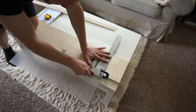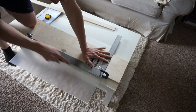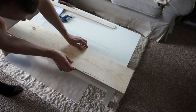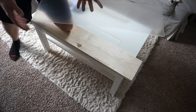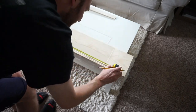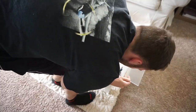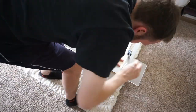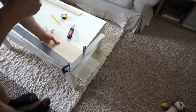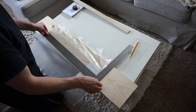Then you need to take a gouging tool — I actually have an acrylic gouging tool that I'll leave in the description. You just go back and forth until you have a good gouge, then pull it back and forth until it snaps. It's going to make a really loud noise when it snaps, but make sure you make a ton of gouges before you go for this because acrylic sheets are kind of expensive. If you're not careful with the gouging it can just break in a random direction, so just gouge it really, really well — do it way more than you think you need to.